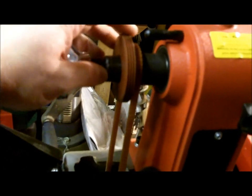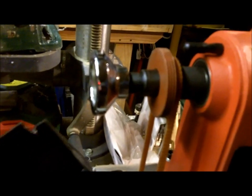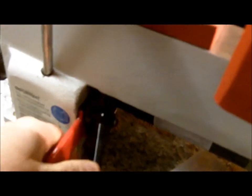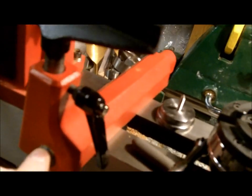It's got this opening hatch so you can get access to the pulleys and belts. At the top there's a handwheel at the end — it's hollow for knocking out the drive spurs and things. At the bottom there's plenty of access for changing the motor pulleys. It's held in by a spring plunger. The knockout bar — from what I understand it's a common way of slackening the motor off, then you lift the motor up with the handle, change your ratios, and reverse the process.